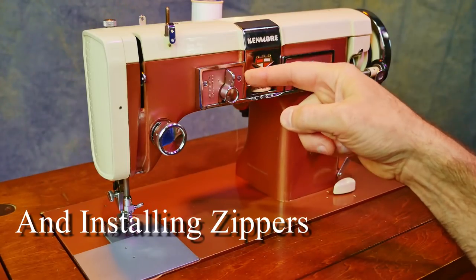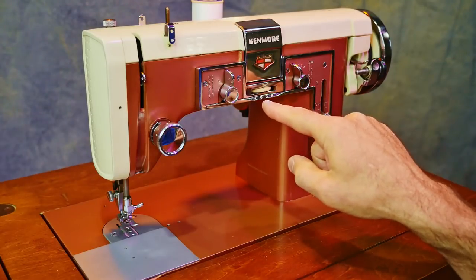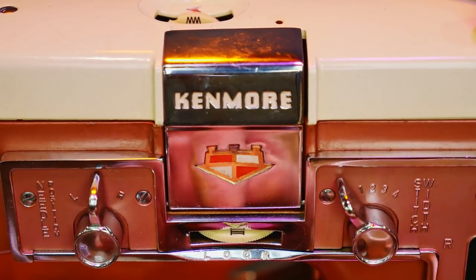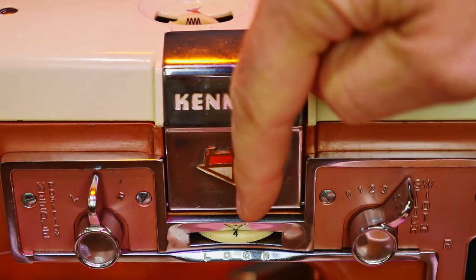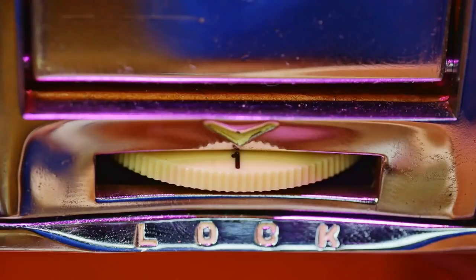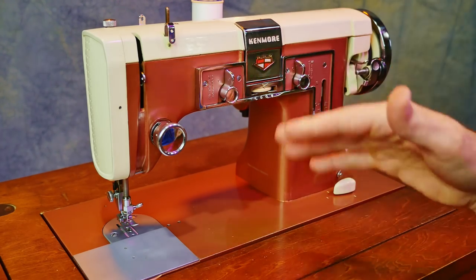This is probably most often used when making buttonholes. This is the lock feature, and what it's locking is the stitch width. Stitch width lock — it goes from zero, one, two, three, four, and then it goes to buttonhole. So if your knob won't adjust all the way, don't force it — be sure and check your lock. If you want to alternate between straight and zigzag at say a width of one, you can set this at one. When this is on zero, it sews a straight stitch, and then you can go up to one. There's a stop there, and back to straight, back to one — you can repeat that setting.